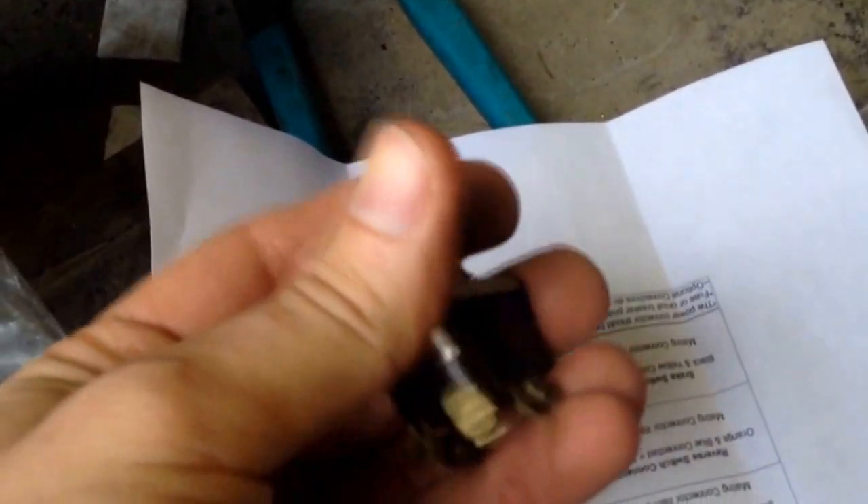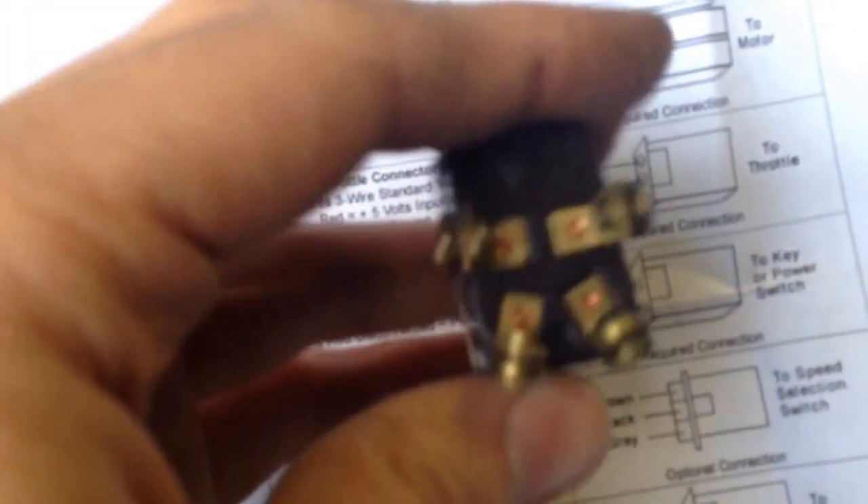Okay, so here's what we've got. It's going to do my reverse switch — dual pole, on/off. So when you turn it on, the reason I'm using dual pole: if you look at the reverse switch, when the orange and blue are connected, the motor is reversed. So orange and blue. We're also going to do the speed selection switch for low, which is black and brown. So when you switch it to reverse, black and brown will hook up to the other side of the switch. When you put it in reverse, it will reverse the motor and it will go low speed — so you'll have low speed reverse, so you don't go full speed. Anyway, we'll get it wired up. Thanks for watching.